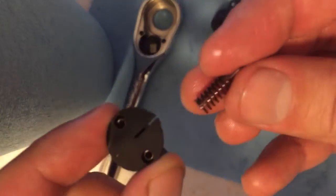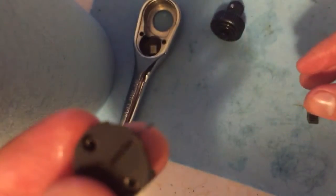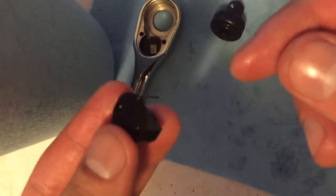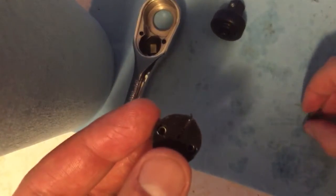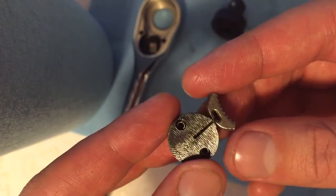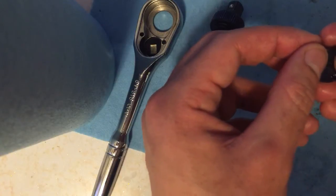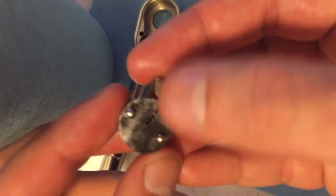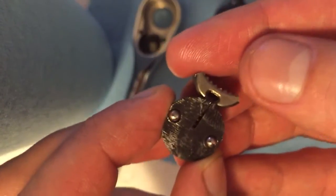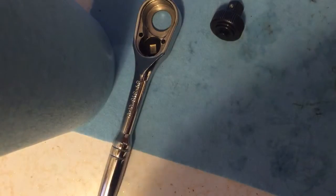So what you do is you put the spring in through here, like so, with the little arm on the spring facing down, like that. You run the detent right here into this one little assembly. Then very carefully you put on the bearings. These are for positive engagement. On the selector switch, when you select on or off, that clicking, well, it's held in place by those bearings, okay? Now this is the tricky part.